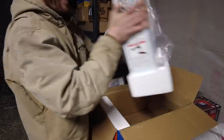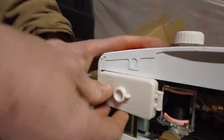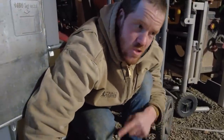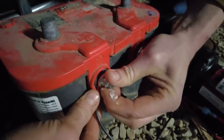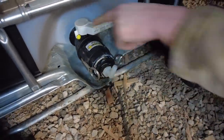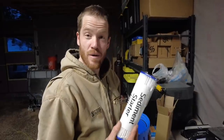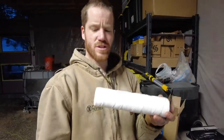Now that we're back up at the shop we have the water from the tote transferring to a tote inside and filtering it again, which means we can cross it off the list. Next up — water heater. This should turn the pump on. Long term we'll have the pump hooked up to the EcoFlow, but this will do for now. This time I'm going to take the wrapper off the filter. This came with a 30-micron filter — same size we've already filtered this water with twice — so now we're going to swap to a 5-micron filter to get the last of the sediment out. Also, I'm pretty sure this is just a thing of yarn.